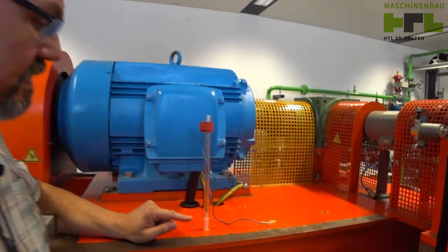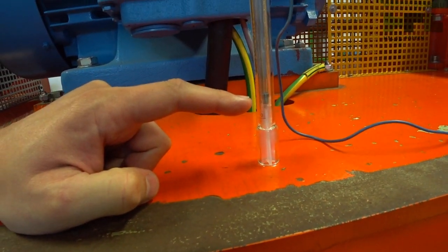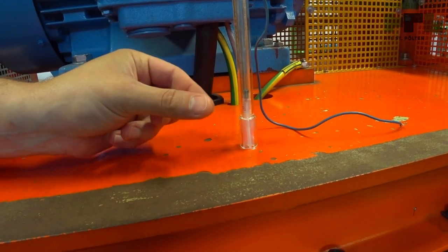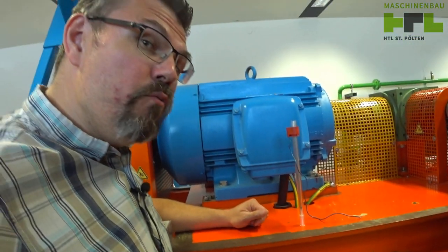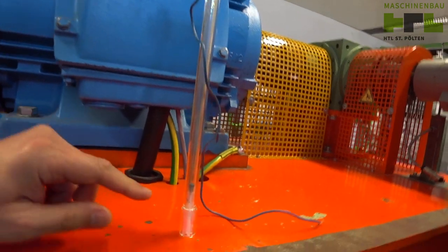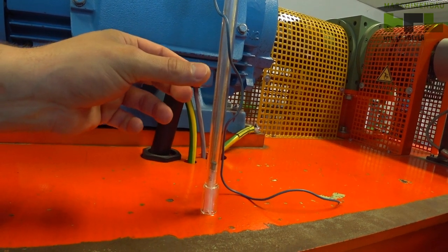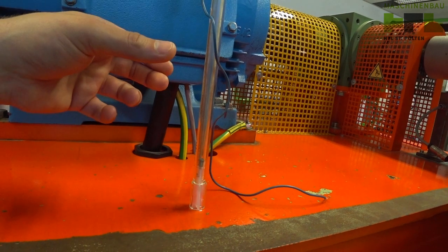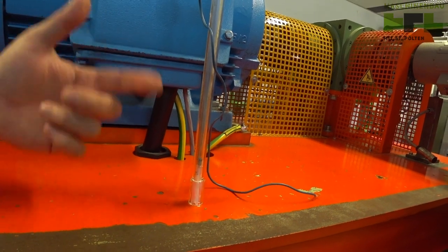What goes up and down is this little device, this little floater down here — you see this metal device. The inner tube is not cylindrical, it's also conical, so the floater will ride on the fluid, usually a gas, which is streaming through this device. It will simply ride and stay at a certain position wherever the diameter of the inner glass tube is big enough, because it's also conical. So we will reach a certain height at a certain flow — that is how this works.